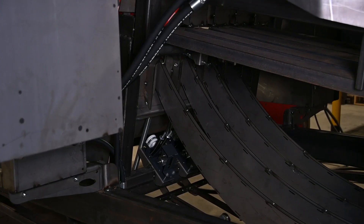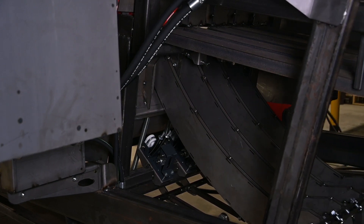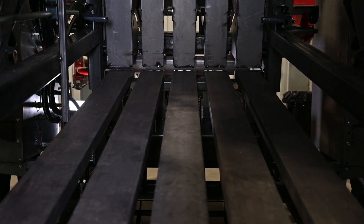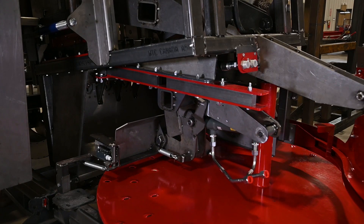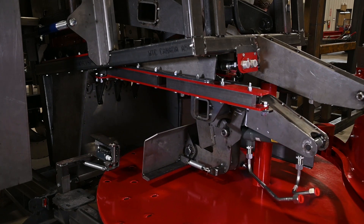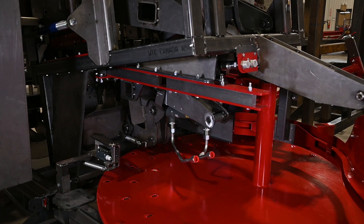Right now we are checking the smoothness and accuracy of the needle yoke operation with respect to the knotter at the top of the machine. The plunger must move freely and have the appropriate clearances to the chamber to ensure proper compression of the bundle. The injector mounting is now located and welded in the same fixture as the rest of the chamber. This takes any twist out of the mounting, resulting in smoother and more accurate operation of the injector mechanism.